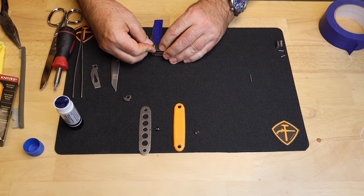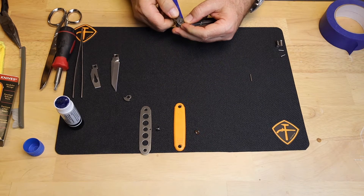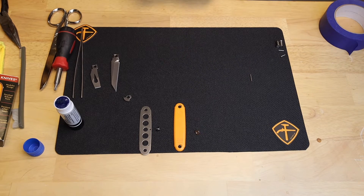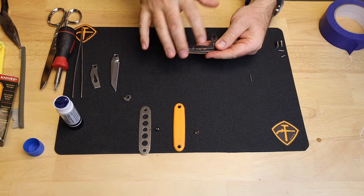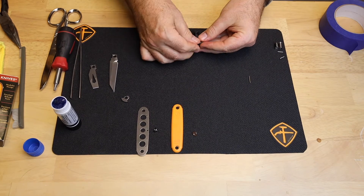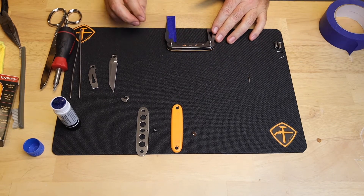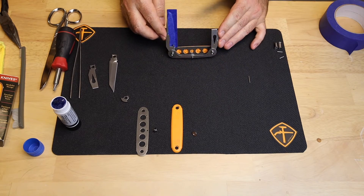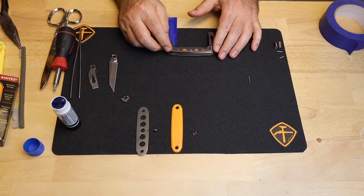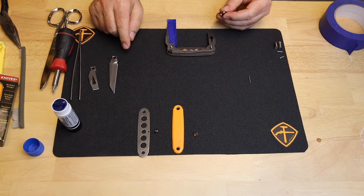You'll notice as I push this up that the pivot seems like it's in the way — and that's normal. Push it, and you can push this against the side of a table until it pops. As soon as you've got it popping in, it's going to want to oil-can and do some funky stuff, so just work it down a little bit at a time all over. Try not to do it all at once — work it all down flat. Next, we need to make sure there's a spring with that blade on the third part. You'll put your last spring in. Opposing that spring, you're going to put a spacer if you're putting in a blade.